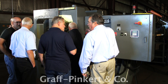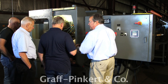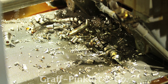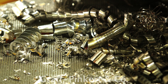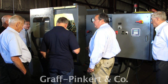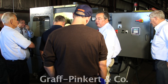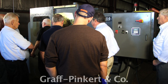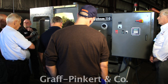We stop the whole machine and there's a dwell - the dwell lets the chip break off. Every time there's a dwell there's no feed, so the chip ends and goes down. If you look at the bottom of the machine you can see the difference. We can adjust the length of the dwell time or the length of the pulse. This has six pulses during the feed cycle, so potentially you break the stringer off six times - but you could do it a lot more, it's completely adjustable up to 99. Six just seemed like a reasonable amount, and there are no bird's nests in there.